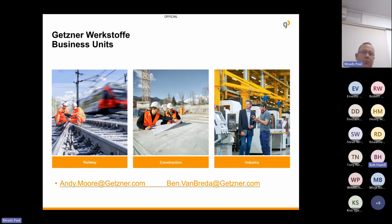A great presentation. Talking to one of the converted, I have to say, we installed some undersleeper pads back in BR days at City Thameslink, through the platforms, which would have been in the 80s. I'm aware that for 20 years we never had to tamp that. Admittedly, it was relatively low speed, and I don't know if it was a Getzner product, but it was certainly an undersleeper pad, and it was really effective. So that partly proved the benefits. And we also used your product at Shortlands when we put the dive under in there to insulate the structure.